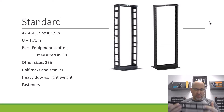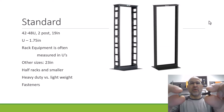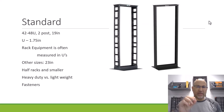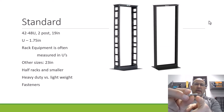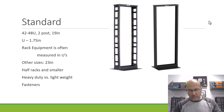How would you mount this to the rack? Well, if you've got a heavy duty rack, then you might have standard rack screws such as these — a couple of different flavors. The best kind: they mount to a heavy duty rack and screw right into the metal of the rack. The rack itself is made up of steel or iron, sometimes aluminum if they're lighter weight. Rack screws like this also have a taper on the end of them, so once they go in, it's easy to find the hole and you get a little thread engagement — it'll stay there while you screw in the rest of the screws.